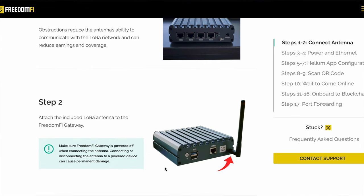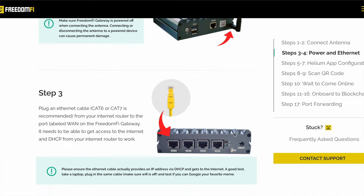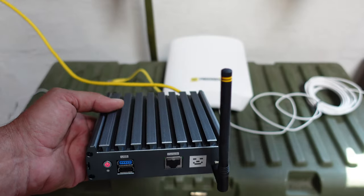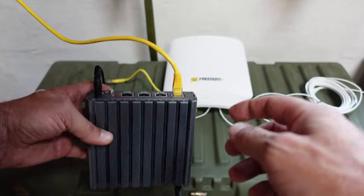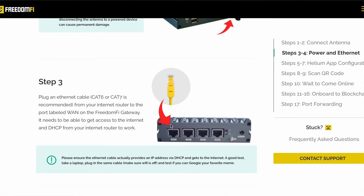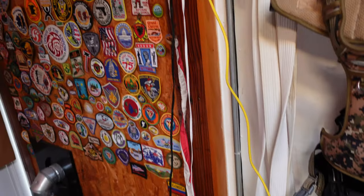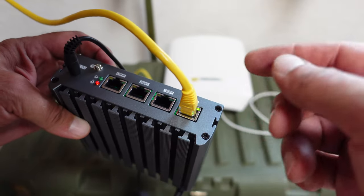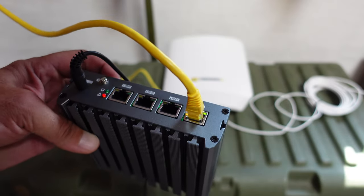Make sure there's no power going to anything first. The first thing you're going to do is install your antenna. I'm going to hook up my external antenna pretty much as soon as I'm done with this video and affix everything to its permanent location. Once you have your antenna hooked up, the next thing is to hook up your patch cable — cat 6 or cat 7 — and make sure you connect it to the WAN port. From the WAN port that goes into your home router. The bundle only came with one patch cable, which I was using for the radio, so I needed to get an extra one.